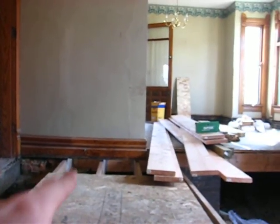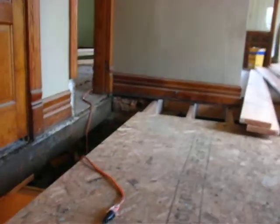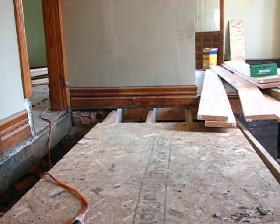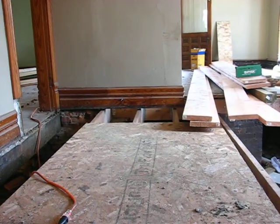Now I just need to go back and make sure I put four nails in between each joist — trying to get that done. The mason called and they're going to be out tomorrow morning to finish backfilling the rest of this. I'm going to try and put a little bit of plywood down in here tonight. Jake is coming out to help me tonight, and I haven't decided yet if I'll put plywood down at least to this floor joist, or if we'll work upstairs.